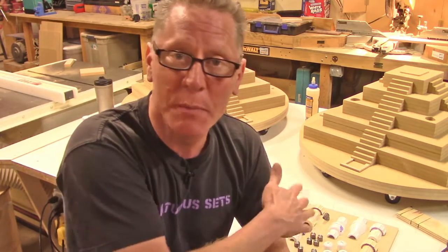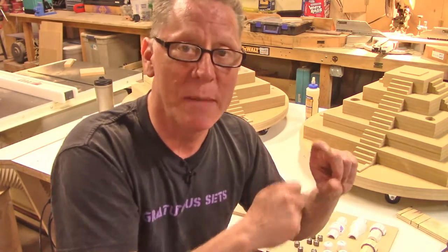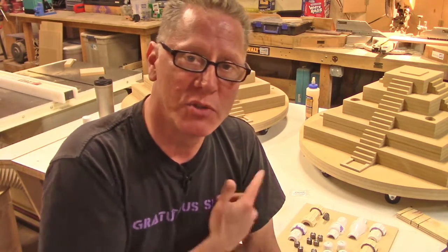It's a simple box mold, open back, so that you can just pour your scrap in easily. You don't want to do this as a two-part mold because then you need to have the correct volume. So open back, simple mold, and we'll show you what we're doing.